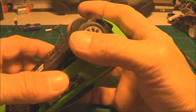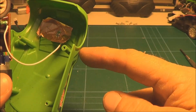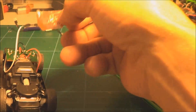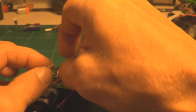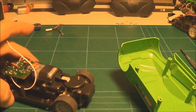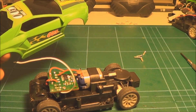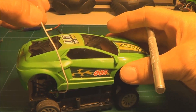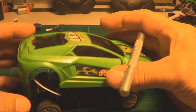I'm going to try something on this one — I know what's inside. A lot of cheap RC cars do this: the aerial is tucked in and looped up, and they've got conductive foil on the back of the car. This one looks like they took some material off the end and connected it up, which is really good because a lot of the time they don't. The idea is that it conducts onto the foil and the foil becomes your aerial. From what I understand, these aerials work best if they're up in the air nice and proud. So I'm going to work out where the aerial comes out and make a hole.